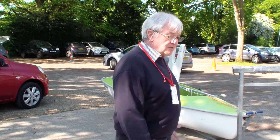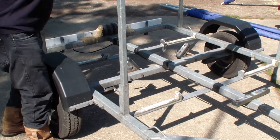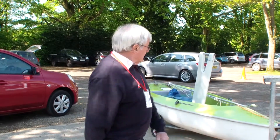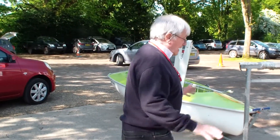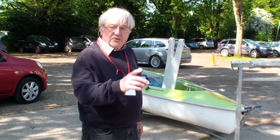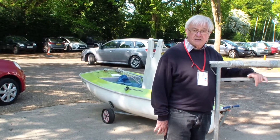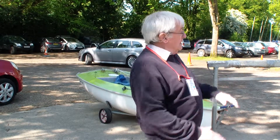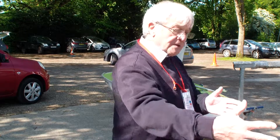We're starting now with the bare trailer — this is where we would normally come in. The keels go in first, strap them down — two keels. We then pick the boat off the trolley, with the keel already on the trailer, bring it in, slide it forward, strap it down, and tie it down at the front. Having got that in, we take the boom from the top boat and strap it down to the bottom boat. Having done that, we put the masts in and strap them down. Then we take the small boat, pick it up off the trolley, turn it over, put it on the top, and strap it down. The final job is the trolleys, which go up onto the top boat — two trolleys upside down — strap them down and put the painters on to stop it going back.